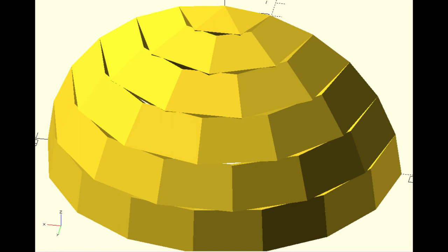I've turned oval bowls before but was not sure I got the design right. So this time I spent a little more time playing with the design and decided on a segmented approach. Given that my initial bowl would be cut in half, I thought to start with a spherical shape. Usually a segmented bowl has the layers bricklaid with each segment overlapping by half, but that would mean that after being cut at the edge, half segments would show. I wanted better than that, so I modeled a sphere with varying segment count per ring. If segment counts are always an even number, I can cut it in half at a joint and still have the segments overlap.